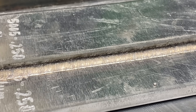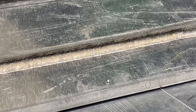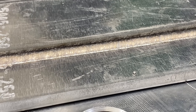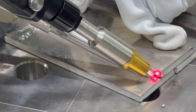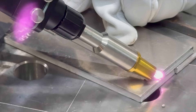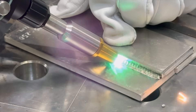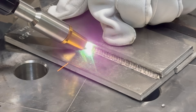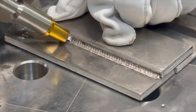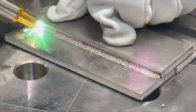Dialing in the settings on this thing is kind of like a MIG welder — with voltage and wire feed speed being the main variables — except with a laser it's more like kilowatts and wire feed speed. Finding that sweet spot is very similar. In scale mode, it's like a pulse on a TIG: going a little slower, filling in better, and putting a set of ripples in there like a stack of dimes.